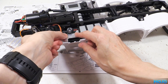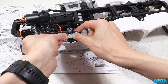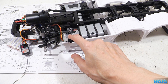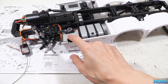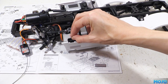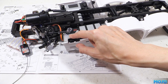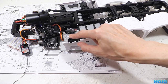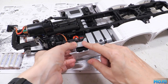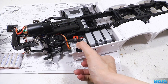The plates for the steering side are GG7 and GD10. GD10 is the interesting one — offering it up to the top of the tank, it doesn't quite fit, though it's close. Moving the steering lets the plate drop into position, but moving back to center pops it out. So I'm going to cut up another aluminium arm and set it up about a millimeter shorter. It might have been easier to size the arm after having all the other bits on the chassis, but the arms are very cheap so it's no huge loss.